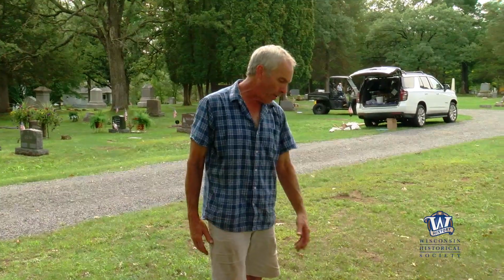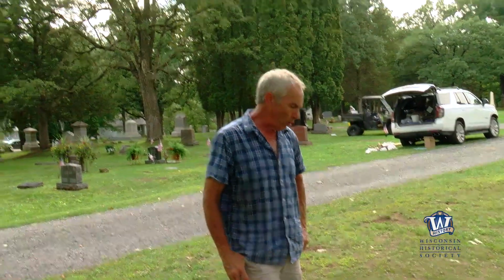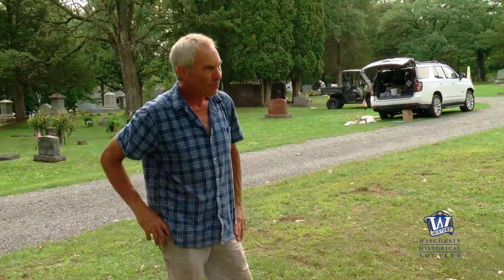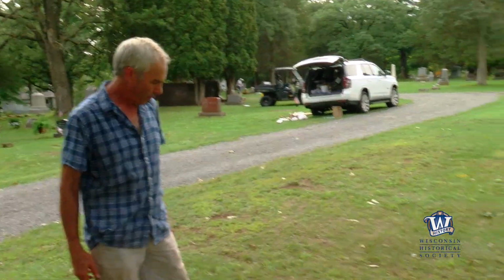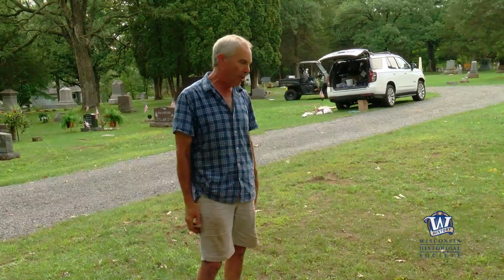You could put a backer stone on it if someone really wanted to, which would be a whole other piece of stone along the whole back, which wouldn't really change the aesthetic of the front. You could gain a lot of strength that way. It seems like in different areas of the region, they were telling me in a lot of parts of Iowa, they put like metal fence posts behind them to try to get them up, and they do some. Have you seen those? Not a lot, but it would make sense. There's no one simple answer, but you'd have to come up with some structural support to reinforce it, to brace it, or it's going to tend to break again. Would you put that epoxy on it with a backer stone? You would. Hold them together? That would certainly be an option, and probably you'd want to join it like that in some way, but it's kind of a complicated thing to fix.